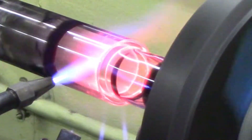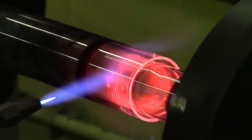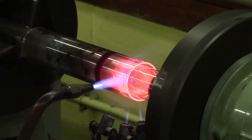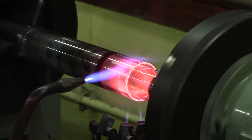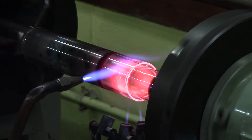There's the stick. After the glass is stuck, I'm going to move my burner eight millimeters in on the sapphire and concentrate my heat there. The idea is to let the sapphire get hot and radiate the heat onto the glass so it'll gradually wet and you can work it that way. If you heat the glass directly, you're going to overwork it and the sapphire will be cold.